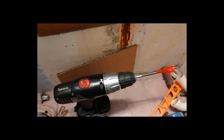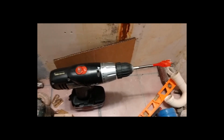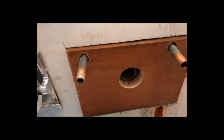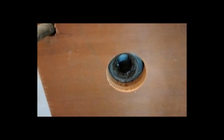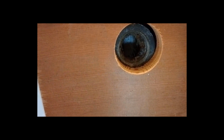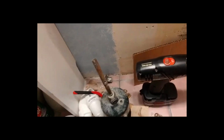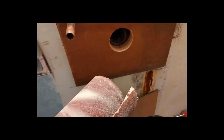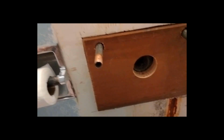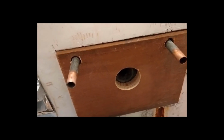Okay, now I've had to go back and get a different kind of drill bit because I didn't see an arbor that would make that thing work at all. Good thing is they traded it in, swapped this out for this other kind of bit. I drilled the 2 holes for the pipes, but I do have a little bit of an alignment problem with that drain. So I'm going to mark that out and expand that kind of to the bottom and left of there by hand. I'll sand it out with this little roll of sandpaper, just basically a roll of pretty coarse sandpaper, probably 60 grit or something. Get that hole widened out so it can fit the rest of the way down, and then I'm going to have to work on something to keep it in place so it doesn't move forward or backward in that hole.